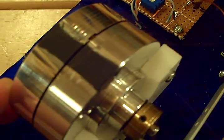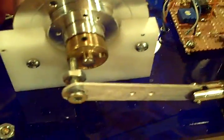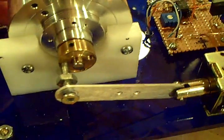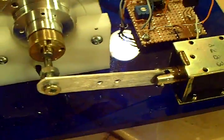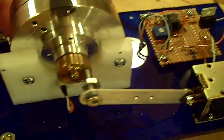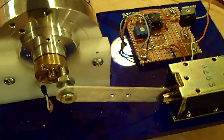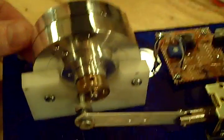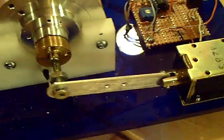I put a line on the head here — this shows that this is the power stroke. As the light passes through, the comparator is triggered, drives the transistor, and the solenoid fires. You'll notice that the solenoid is positioned furthest away, so as the solenoid is triggered, it pulls in — and that there is the power stroke. Then the solenoid shuts off at about this point, the momentum of the head keeps it going, spins around, when the two lines line up again — the power stroke — and then it continues.